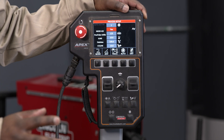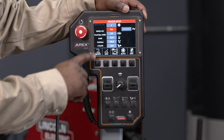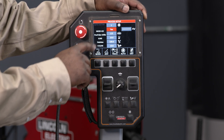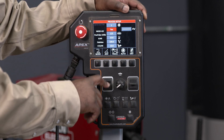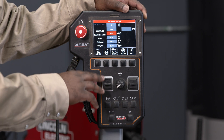After that information is loaded you're going to be presented with that information on the left-hand side. It says it's in mode 423, using precision pulse argon mix, and it has the wire information and the gas information below. The next thing I'm going to do is move down to the wire feed speed — I'm set for 125 inches a minute and that's where I want to start.